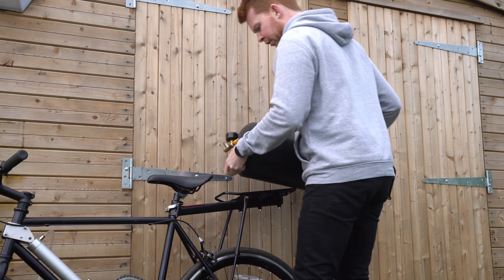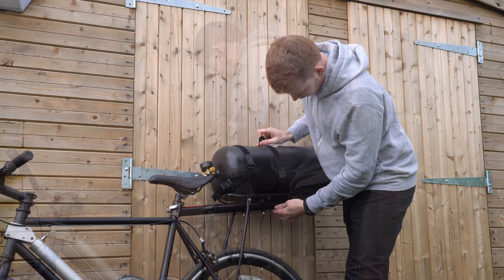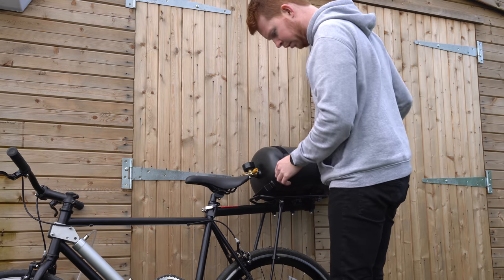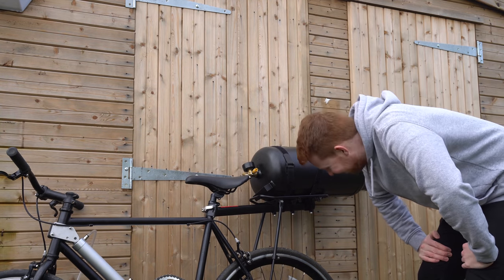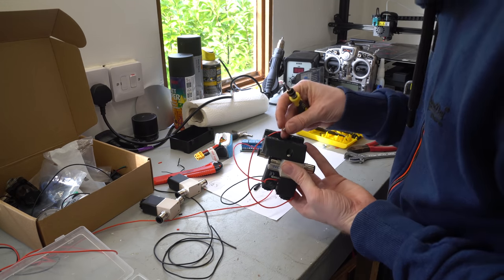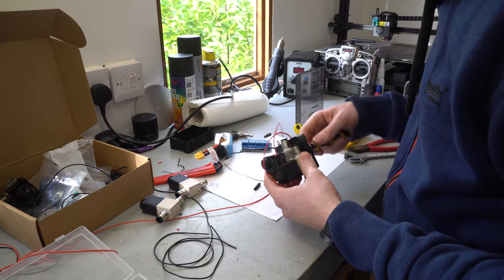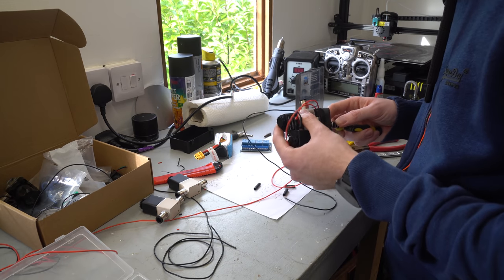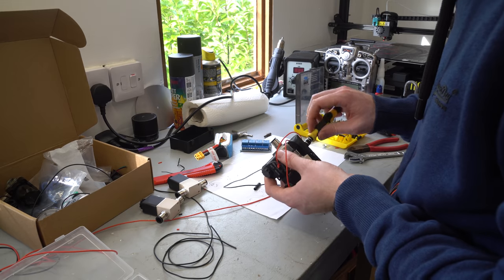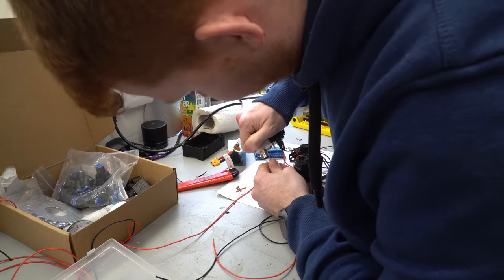Then came the task of mounting the huge air tank. To control the airflow from the tank to the pneumatic cylinder there must be an arrangement of valves. I've chosen to use electronically controlled solenoid valves for simplicity and cost. If I were to design and machine mechanically operated valves, the time required to build this bike would be far greater and still give me the same end result.